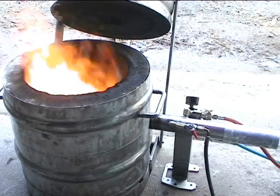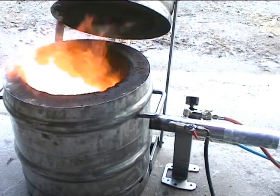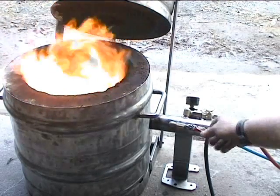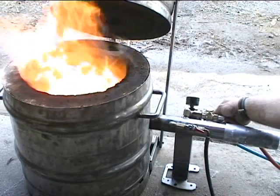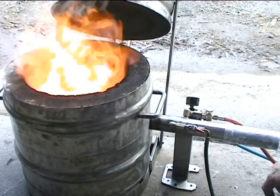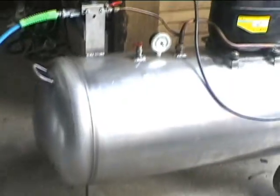This is a regular air and oil mix and I'll get a different flame. Put my hand over the back of it and I'll get a different flame again. That's my hand over the back, restricting the oxygen. That's full throttle oil. It's now running at 10 pounds of air pressure. Still running at about 80 psi. The compressor is running. Stainless steel gas tank.